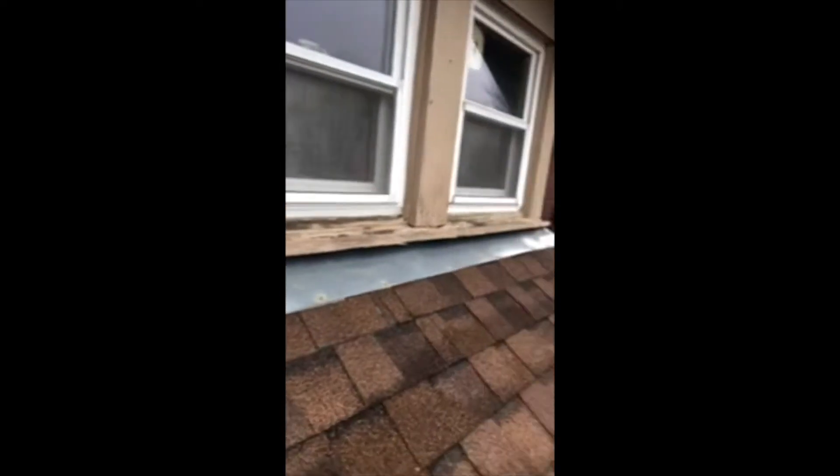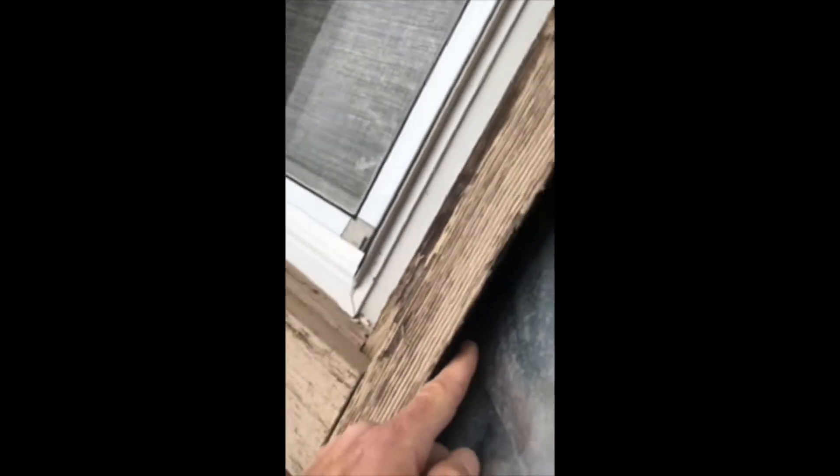We had some flashing here, at least that's what it looks like. But if you look underneath here, that flashing isn't doing anything. I'm touching wood, so that flashing should actually go vertical back under here to stop any water, snow, and ice from backing up or blowing and getting in underneath the roofing material. So here's the sides of this dormer.